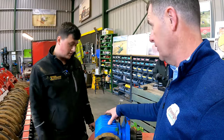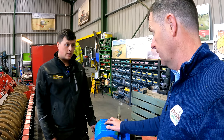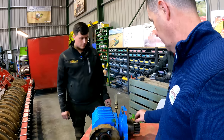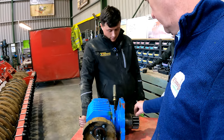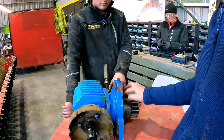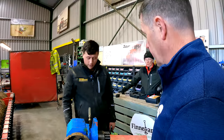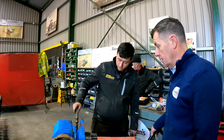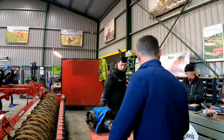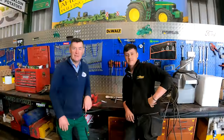Yeah. And two of the bevel gears inside, one of them was salvageable, the other one was completely gone with a chip out of it. This gear here, I remember on ours, had a little bit of wear, so they had a second-hand gear which they would have put on it. Oh, it's not too bad. And new seals is on it, and yeah, it's ready to pop back on, so hopefully now. Very good, very good. Should be able to get that back on the road anyway. Yeah, but nothing simple, as you know. No, there never is. That's it, that's it. So now it's time for...